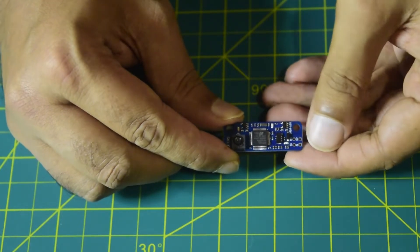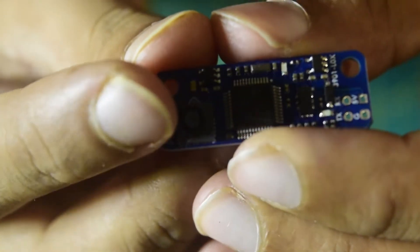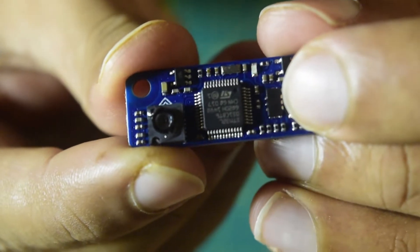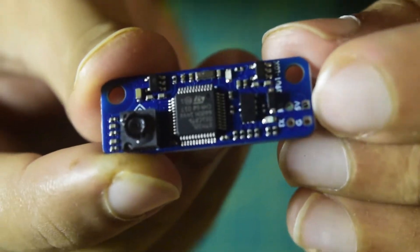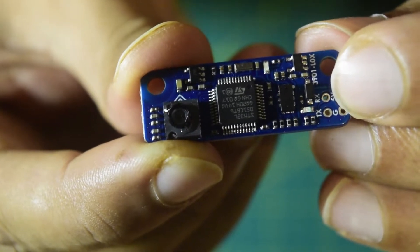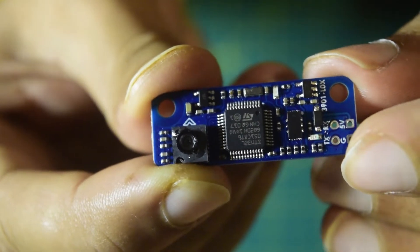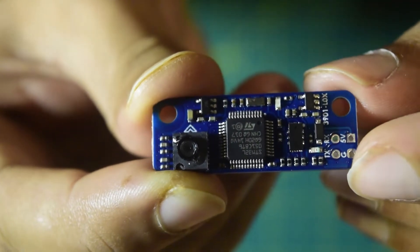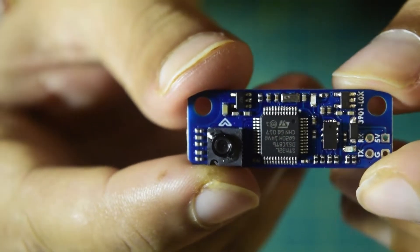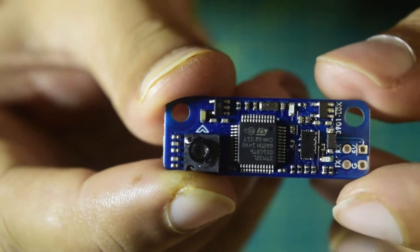Now let's see the ports available on the sensor and how to connect it onto your flight controller. You can see this is your optical flow sensor which looks like a camera, and the smaller chip is your LiDAR sensor for sensing height. It has four ports: TX and RX pins so you can connect this sensor onto any free UART on your drone, plus ground and 5 volts to power the chip using the 5-volt supply available on your flight controllers. When powered, it draws around 40 milliamperes of current, so ensure your output port is capable of providing at least 40 milliamperes.